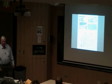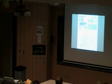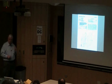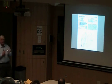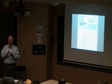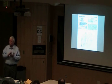This is a patent by Jim Baker, our lens designer, for a particular way of making 2 pieces that can slide by each other this way. 2 pieces that give a corrected image that can be very good for taking a picture. There's some prior art I'm going to come to. His differs from the prior art by putting a 5th order term in, and we called that quintic, which is where the word quintic came from on some later cameras. But basically, if you slide these pieces over each other, what you experience is a lens that's changing power from plus to minus.